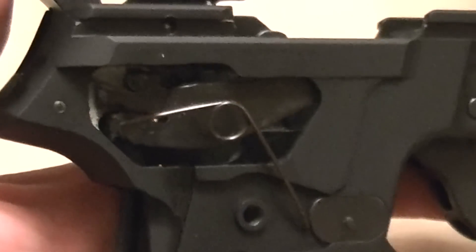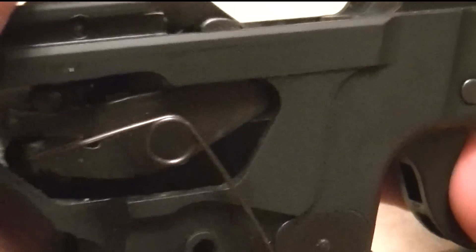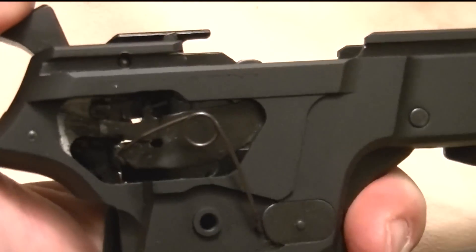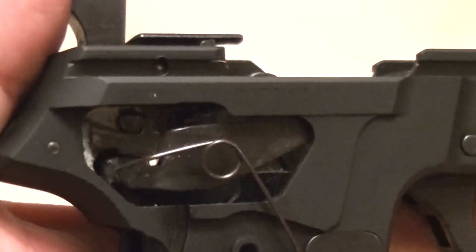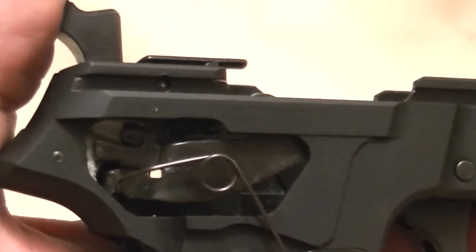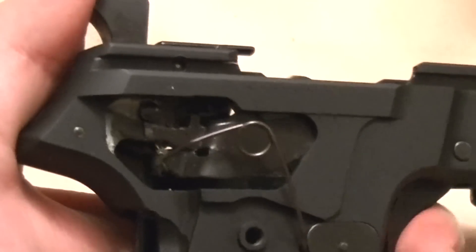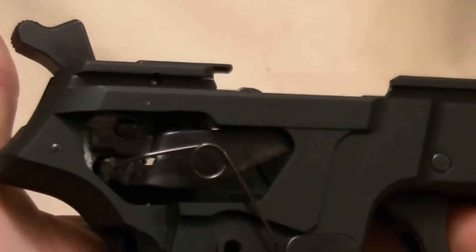If we take a look at the trigger from the other side with the grips off, we can see the entire trigger bar. We can see how pulling the trigger makes the trigger bar move back and forward and affects the hammer as well. If we cock it all the way back and squeeze the trigger and release, what you'll notice is that if the hammer is forward, the trigger will again be disconnected. So unless the hammer is allowed to be cycled back again, the trigger will be disconnected from the gun until you get the hammer all the way back, release the trigger, and then it's active again. That disconnecting bar basically keeps the gun from shooting if the slide isn't closed and everything is not properly seated.